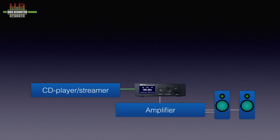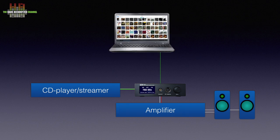Depending on the device, you use a special 75 ohm RCA cable for SPDIF, a special 110 ohm XLR cable for AES-EBU, or a Toslink optical cable. You can also connect a computer-like device to it over USB, whether it is a desktop or laptop running Windows 10, Mac OS, or Linux, a Raspberry Pi with appropriate software, or a smartphone or tablet running Android or iOS.